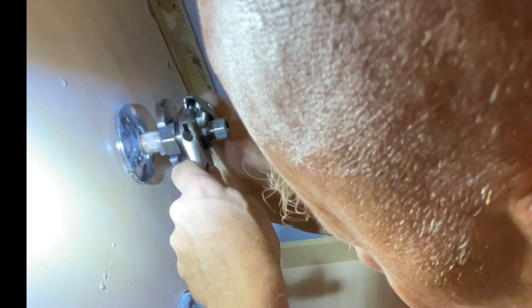The new collar came with the valve, so we're going to slide the new nut and the new collar on there, then the new valve — tighten it — and that should be good. The reason this is happening on all these valves is the same reason on every valve: the old valve was deep so the collar sat back further. When I put the new valve on, that collar doesn't move, so it couldn't slide up to meet the new valve, leaving a slight gap and causing a leak.